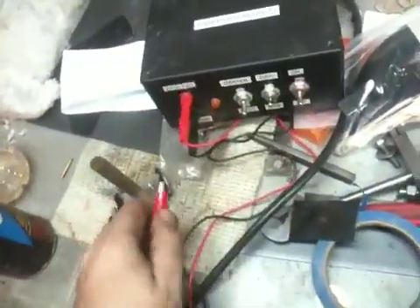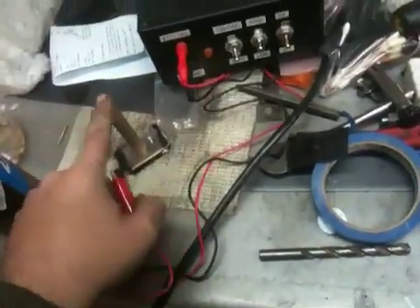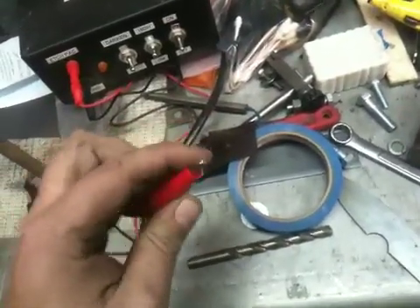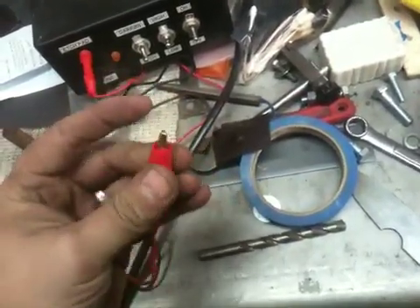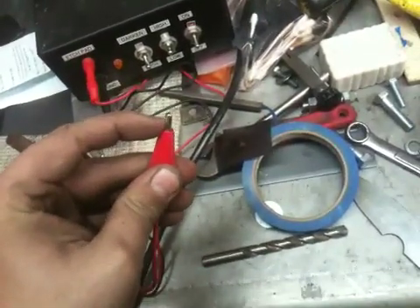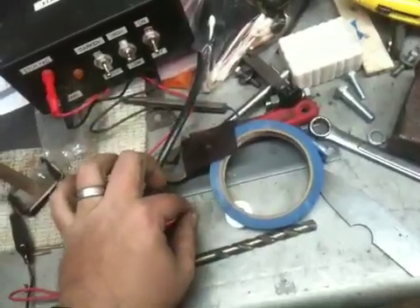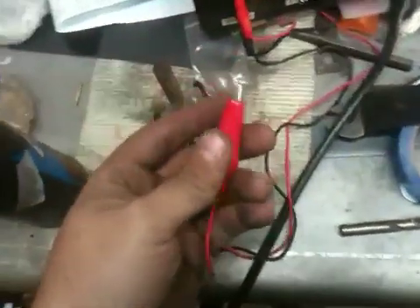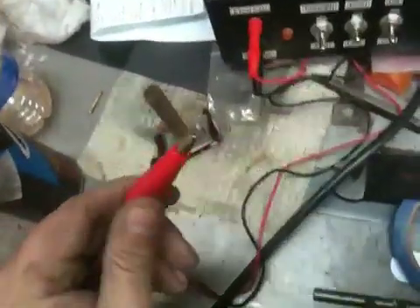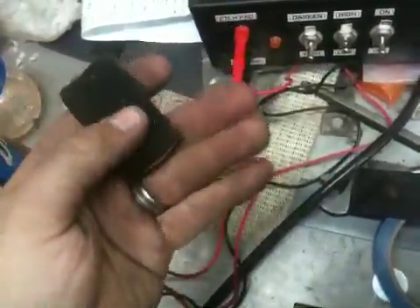I have my felt pads rubber-banded on there for my etching solution, and this works extremely well. One reason I did not hardwire this to the etching pad is I wanted to leave an option to be able to use Q-tips. There is a method where you dip the Q-tip in your solution, clip this on the end of the cotton swab, and then you can use that to dab on your tiny etches and do finer detail work. I have used that in the past — it does work quite well — but I think I get the most consistent results from my etching pad.